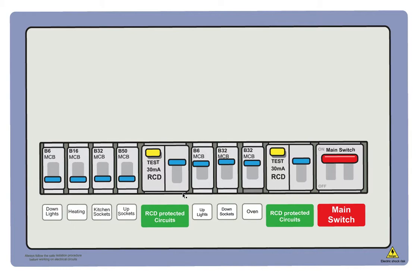such as your hob extractor. Switch that off. If you've got any appliances, unplug all your appliances. Your washing machine, your dishwasher, your kettle and things like that. And then with everything unplugged, see if it'll stay on. So if you switch the kitchen sockets back on and it trips again, and you know that you've switched everything off, that possibly might be a time to start thinking about calling an electrician, because all we can do here is try and isolate it to a particular part of the circuit or a particular device which is tripping it.